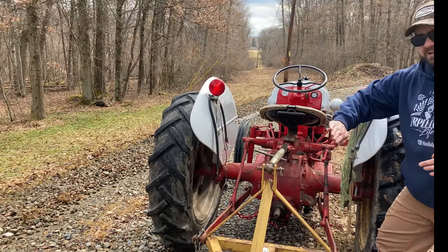So if you're looking for something and you have a gravel driveway and you'd like to prevent yourself from having to buy more gravel right away in the spring when it's just squishing down into that softer dirt underneath — back blade, old Ford 8N tractor. I'm going to go ahead and swivel the blade so it's straight, then come down and take the crown off the edges. If we find we're grabbing too much gravel digging down in, we can always adjust the top link so that instead of digging in, we're just covering over the top, or we can swivel this blade backwards so that it's just scraping along the top.